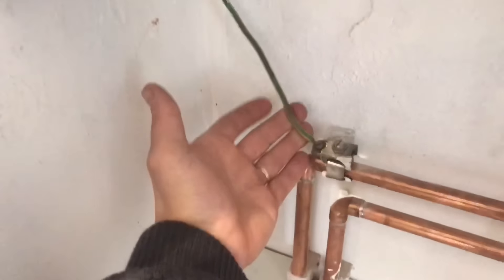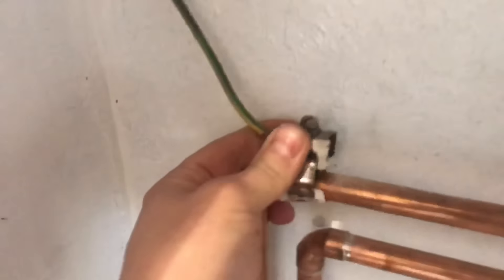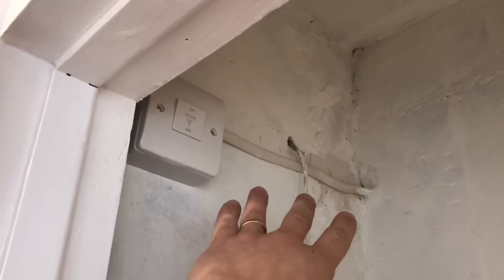Again in here, the builder actually cut a cable. So he then had to put mini trunking on the ceiling — and if you see how straight that mini trunking is: not at all, it just goes on an angle. So he had to refeed this light off of the corridor light. She didn't want any trunking anywhere. What the hell is this doing? Is this just a token earth? It dives out that wall and just goes into a random bin store.